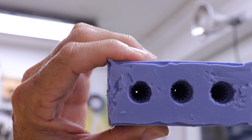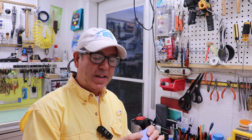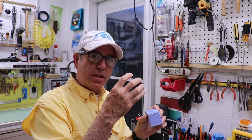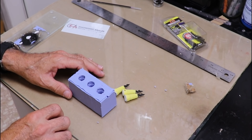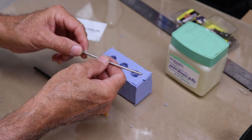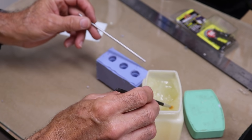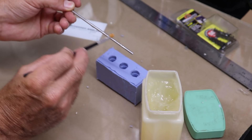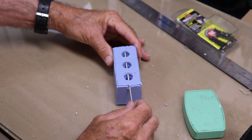I've cleaned up around the rim and you can clearly see through to the bottom and those vents. You might be asking yourself how a vent on the bottom isn't a drain — well they are kind of going to be drains at first. When I start to pour they'll push the air out and start to drain, but then I'm going to put it down on the glass and that should seal it. I'm just going to use my aluminum rod because I'm pushing my luck with that pen — if I mess with it too much I'll end up with ink all over me. So I'm going to smear a little bit of Vaseline all over this rod and then just poke it into the hole.